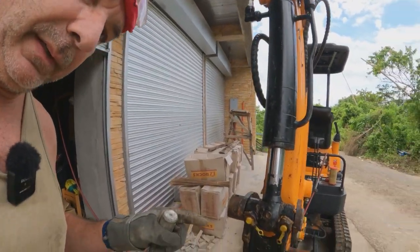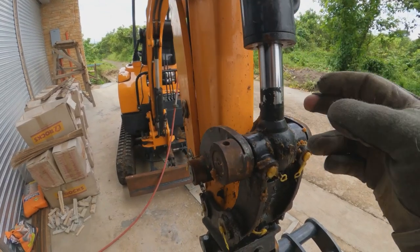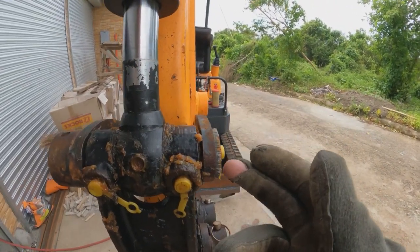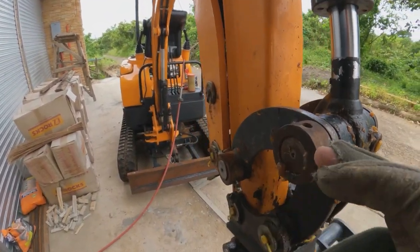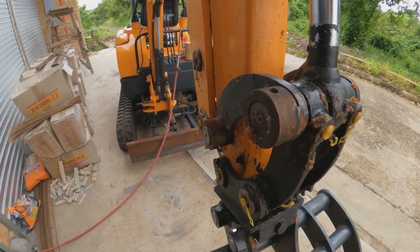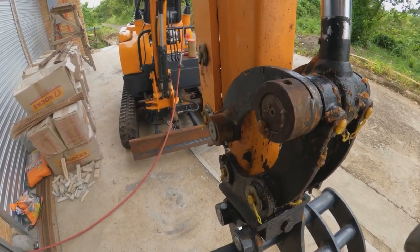The other alternative is to visit a local machine shop here and have them just make me a long 157 millimeter long pin, which won't be much. And that's also going to solve two problems. The pin that you see here from my ram, the top ram, is too short as well. See how I've got it all the way butted against everything, and it's, I mean, it's about 5 millimeters too short. I say 3 to 5 millimeters too short. I can't get a pin in.